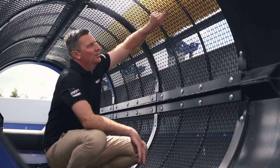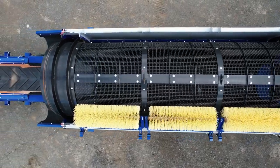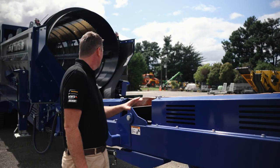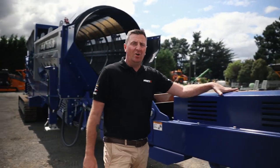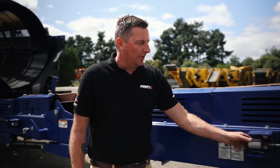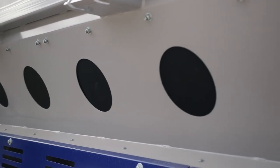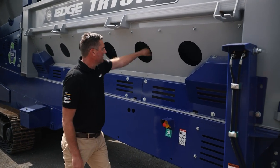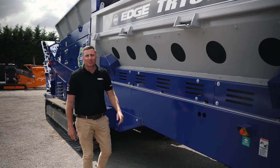Another good feature is that on the outside here you'll see these spring-loaded drum brushes — they just come on the inside, and you can actually flip them onto whatever side you want, so that's quite a handy little thing there. We have the oversize here, so obviously it comes out through the drum — the oversized product — and coming out at a really good discharge height, you can achieve around that three and a half meters through the top side of it. We've been fitting them in standard with auto-greasing — little modules here for the end drums. Another cool feature of the drum itself is when you've got that sticky stuff in there, you've got these big rubber mats, so you can actually quite easily just flick down here and give them a little whack to just trim up that inside a little bit.